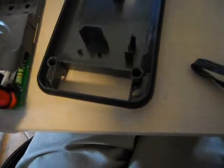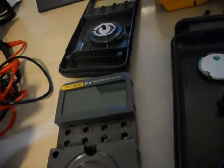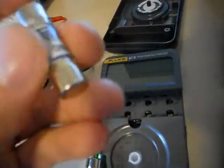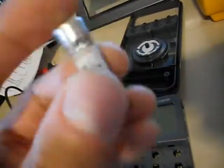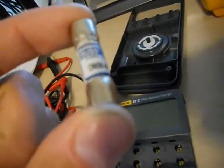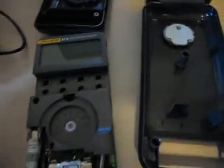Before you put it all back together, test that it works. Another tip — instead of doing the whole test with the dial in different settings, you can also just ohm out the fuse directly. If it's blown it's going to read high. If you have another voltmeter too, you can do that test without taking your Fluke meter all apart. So that's just another tip.